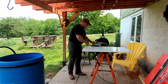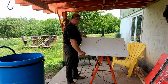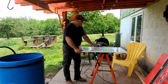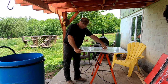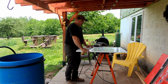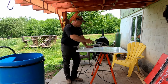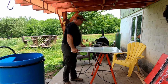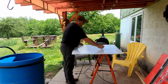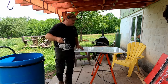I have a piece of three-quarter inch nylon and I made a circle - I put a screw in the center, found the diameter of the inside of my barrel, and this piece once I cut it out will set down inside my barrel and give me a base. I will bolt a block here and have a shaft that comes down into it. I'm going to use the jigsaw to cut this out.